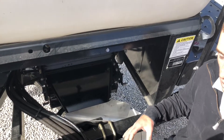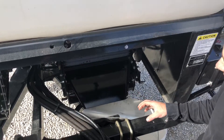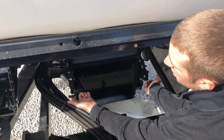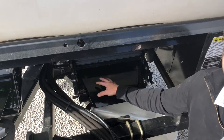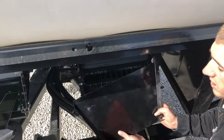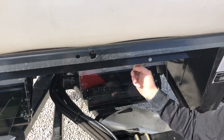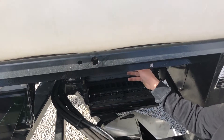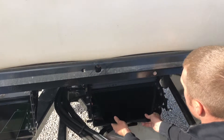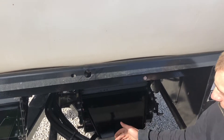Mitch and I are here doing a 24-outlet 6056 setup on a three-point mount, and I wanted to show you how the calibration process works. The first thing you do is pull these levers down to lower the venturis so you can get your catch tray slid in. In a normal working scenario, the clear lid is over the top — you lift that up and lower the venturis to get your catch pan in.